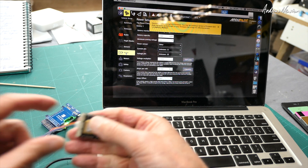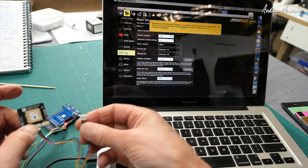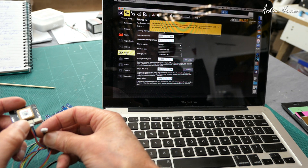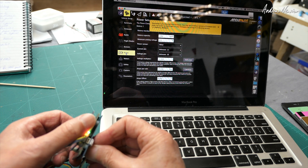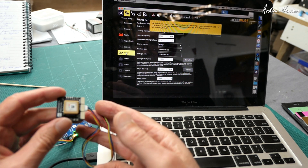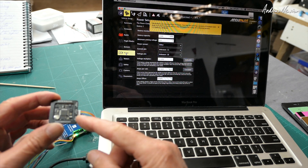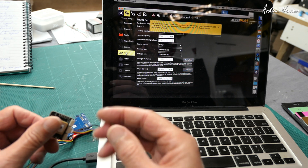I've just noticed there's the GPS — the CAN bus GPS — and the cable provided isn't compatible with the plug, unfortunately. So we can maybe connect it by UART to the board instead. I'll have to have a think about that. The UART is here, I2C there, CAN bus there.